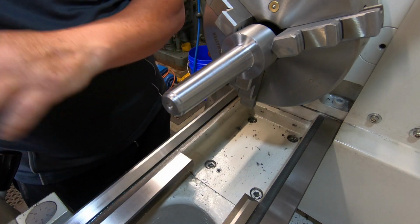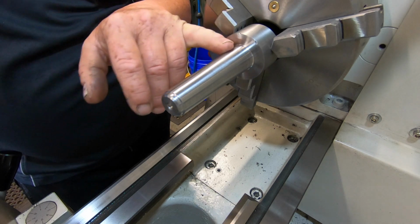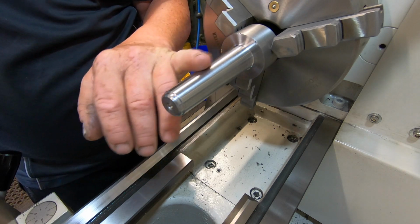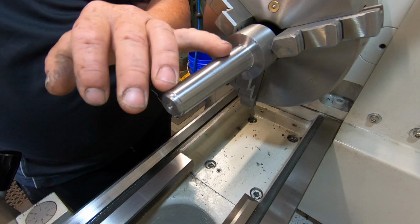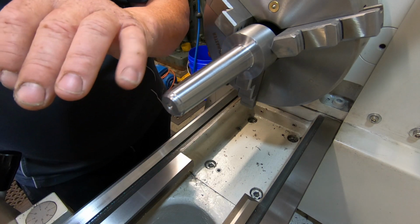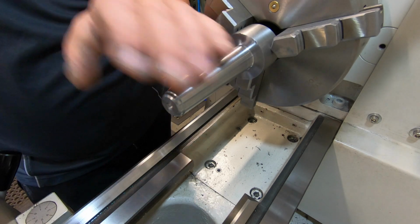And it does help with a lathe that's got long enough travel in the compound to cut it in one go without having to put a relief in the middle and take a second cut at it. And having a lathe with rigidity.